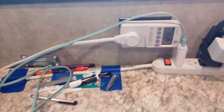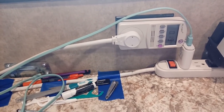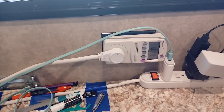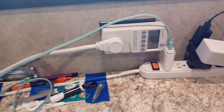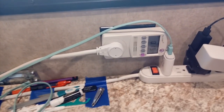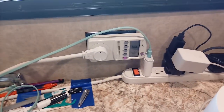Now let me show you how all this comes together. Right now you probably can't read that meter, but I've got it on amps, and it shows that with everything just plugged in — even the Google Home device and all of it — I'm using 0.19 amps, or two-tenths of an amp per hour. So in 24 hours, that would be about 5 amps at that usage right there.